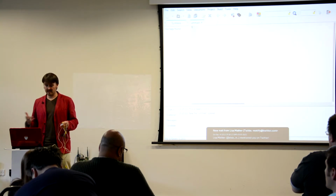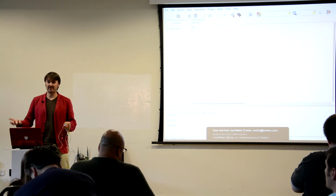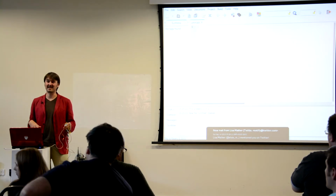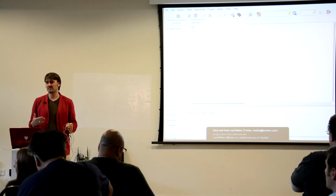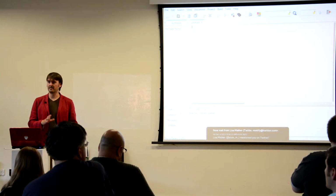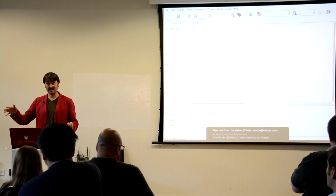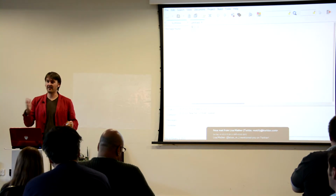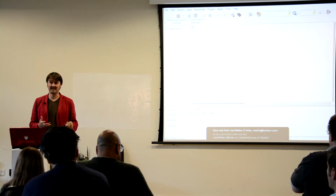But from the situation that we're working with often, where people might be at home and they're like, okay, I've downloaded Arduino, now what do I do? Oh well, there's a whole series of complex things that can get quite badly wrong, versus just hit go. That's the contrast that we're having. So there is a trade-off. We've gone with Arduino compatibility straight down the line because that gives lots of other projects as well. Other people's projects that work on Arduino will go straight onto this. Whereas if you're trying to get it onto an ATtiny, you'll find lots of things aren't quite the same.